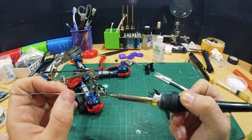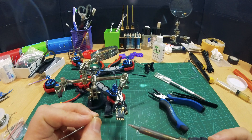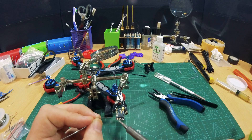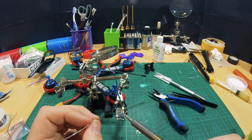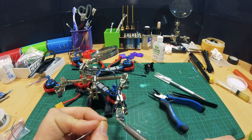We're going to add a little solder. The first one's ground. And then we have 5V in. The transmit pin. And then we have the receive pin.